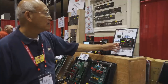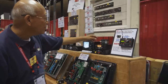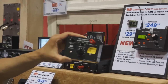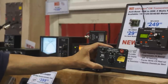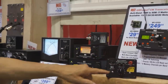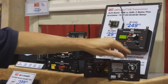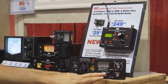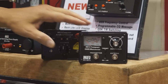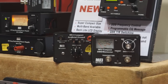The transceiver is $249, and extra modules are $29.95. We also have a whole series of products for QRPers: an artificial ground where you take a short piece of counterpoise wire, throw it on the ground, and tune it for maximum efficiency. We also have a QRP SWR wattmeter with BNC connectors to match QRP radios, allowing you to read power and SWR.